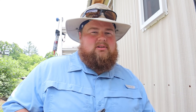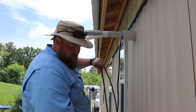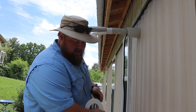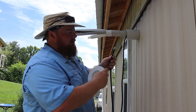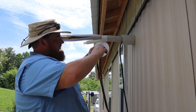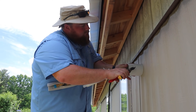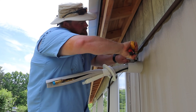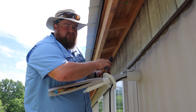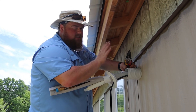As far as my sealant to seal everything up weathertight, I'm using my favorite sealant of choice, which is Lexel — there'll be a link to that down below. It is hands down the best sealant that I have ever used anywhere. Note to self and people other than self: do not run your wire until you've fished it through your thimble. Our boys did all that work fishing the wire and I just had to pull it all back out. Also, Angela had asked if I wanted to use the oscillating tool, and I said no because I would be worried about hitting the refrigerant lines. When you spend this much money and do all this work, the last thing you want is to cut a refrigerant line.